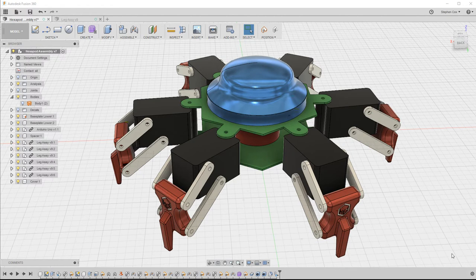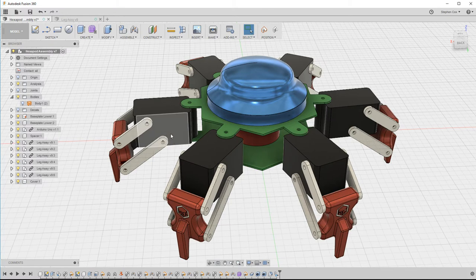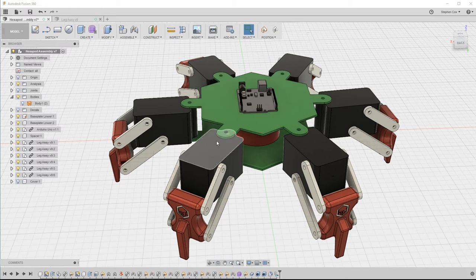And what we're going to do is we're going to start this particular design as an assembly concentrated around the central portion of the hexapod. So these components running through the core of the hexapod we're going to create in an assembly file. These 6 legs are going to be designed as separate parts in a sub-assembly file which we will then import into the main assembly file. So that's the approach that we're going to take, and what we're going to do is we're going to start in the next video with the design of this upper base plate.